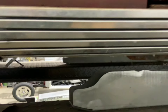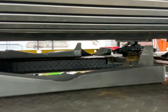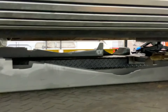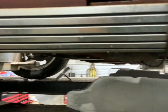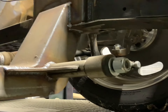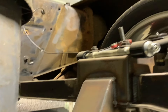Now I've got these badass frame connectors from Auto Metal Direct — check these things out guys. They totally mold to the floor and they're about 11 gauge. What I'm going to do is trim them to fit because they'll butt into my cross member. You can see under there — weld up solid, which would be great. My goal is tomorrow, Memorial Day, to roll it off this lift, turn around, put it back on, and set the engine and transmission.